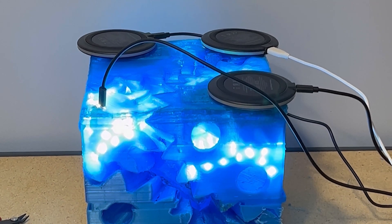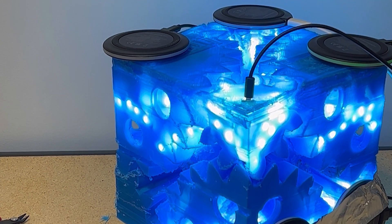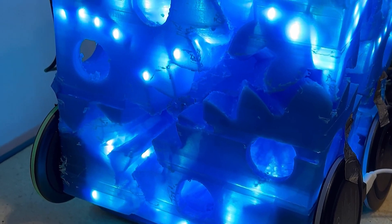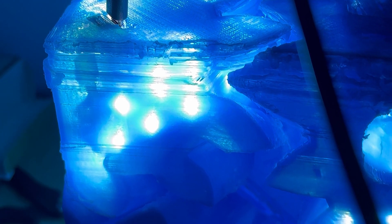Then it was time to test the lights, batteries, and glow in the dark ability of the cube. Miraculously, the remaining seven wireless receivers still worked and the cube could light up. The LEDs weren't perfectly spaced out in the gears, but I didn't care about that. I knew from the get-go that getting perfectly even light coverage was a tall order. Unfortunately, most of the batteries don't seem to hold a charge, and I'm not entirely sure why. It could be that the charge circuit isn't doing what it claims to do, but I'm very gently blaming the wireless charge setup in general, because the one cube that needs to be plugged in actually lasts for about five minutes on a full charge, which is what I experienced in testing prior to embedding the LEDs in the cube. That's right, I did testing. This was not just some fly-by-the-seat-of-your-pants project.